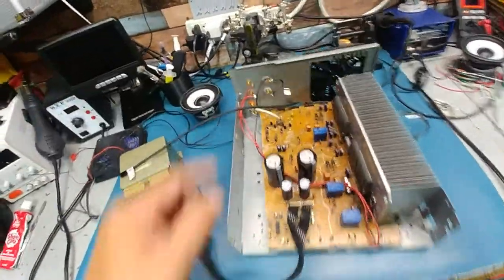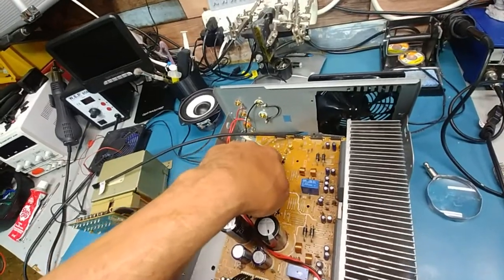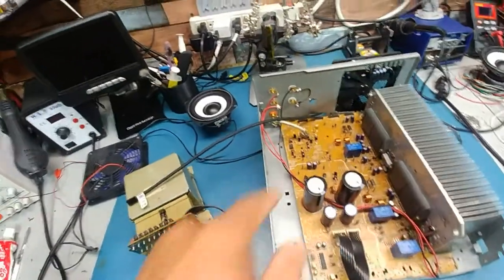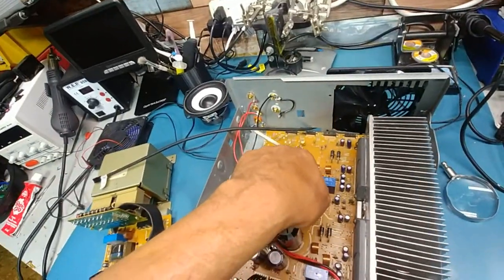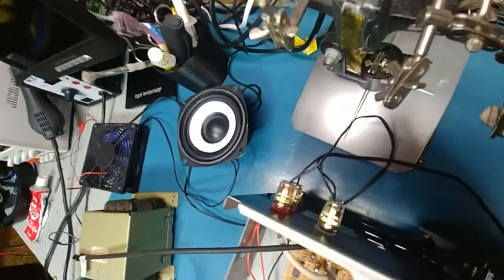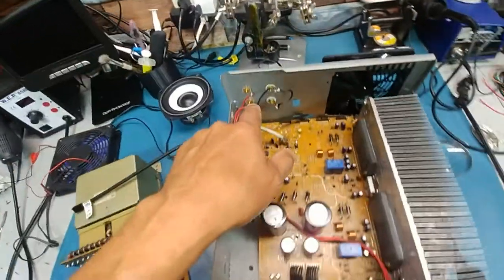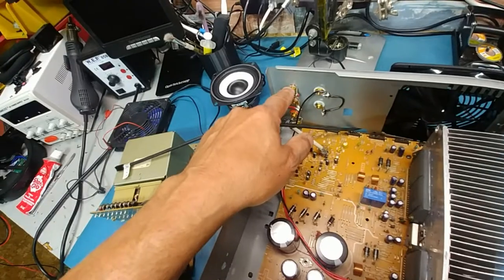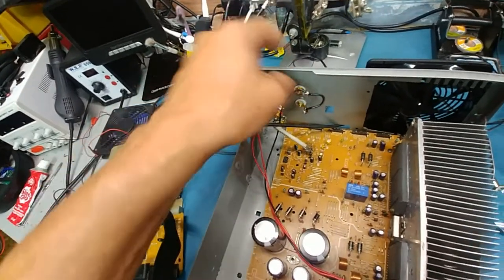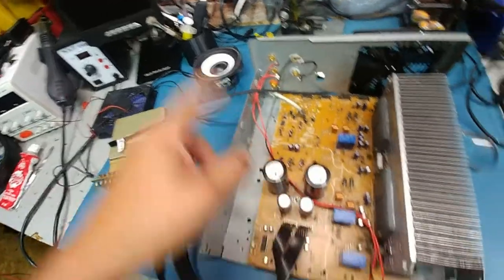I'd still remove it if I had to. Did the input wires, glued that only because I didn't want them to break loose, which I've already done once — they're not going to work again. Did the connectors on the back, drilled the holes. I had to isolate the positives because the negatives were touching the case as well as the positives, so I had to make sure they were not grounding out — but they're not.